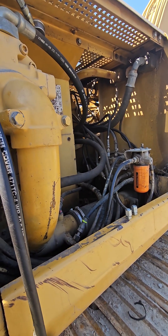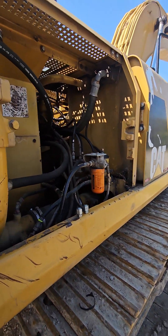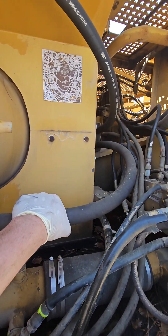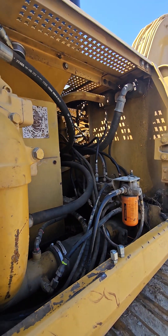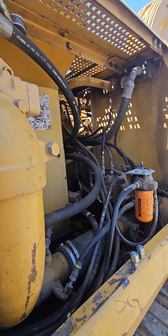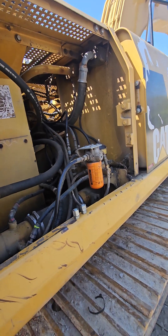You've got the pilot circuit that runs and maxes out at 460 PSI, and that controls all the different spool assemblies that will move these guys, which will power the main pump lines. The main pump system maxes out at 5,400 PSI before the main pressure relief kicks in. There are individual circuit pressure reliefs all over the place, ranging anywhere from about 2,300 PSI to about 5,400 PSI.